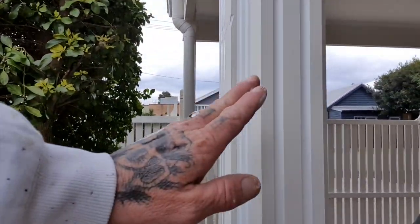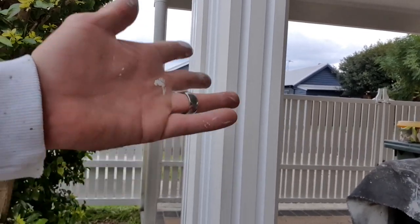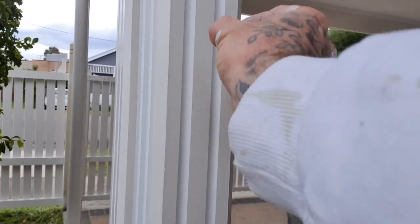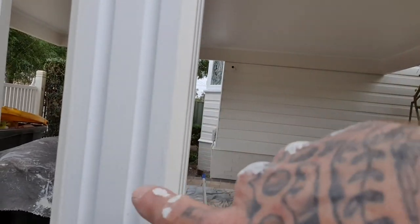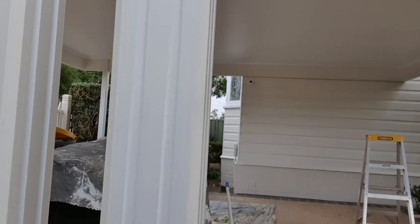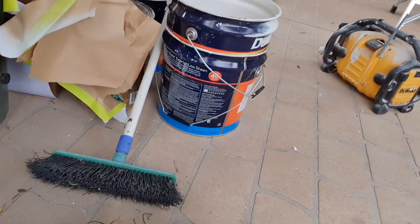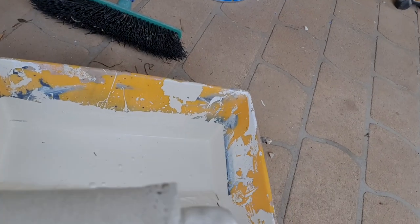As you can see, we've got the inserts obviously white and the cream on the outsides. So what we do, guys - always go through first and brush in these two center bits. As you can see for this one here I've brushed it - it doesn't matter about getting white on the sides because you're going to go over it anyway with the roller. Always use a little nook and cranny roller; you can get these at any paint store, very handy for a lot of paint applications. This is a four millimeter, so it's a nice tight nap.